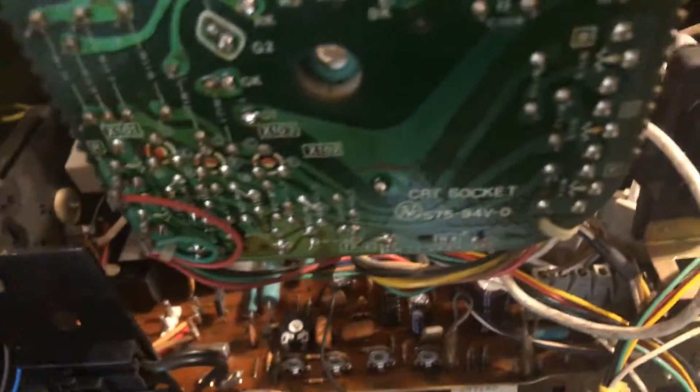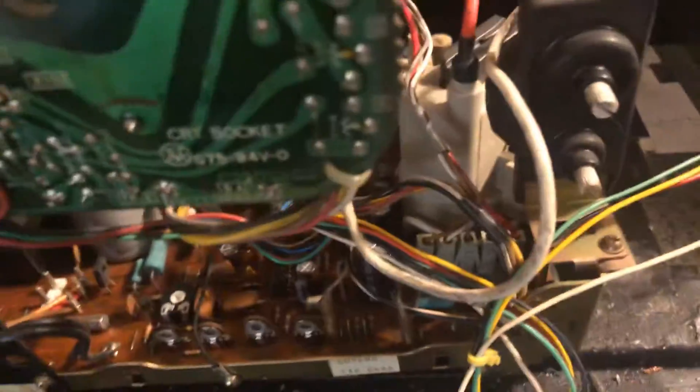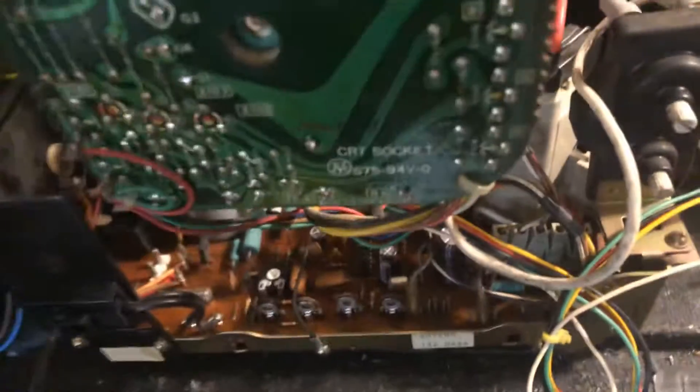It's been on my testing rig for several hours and no problems have come up. All high-end Nichicon caps, it's synced right up. You always reflow these headers if they haven't been reflowed — any cold solder joints have been addressed.